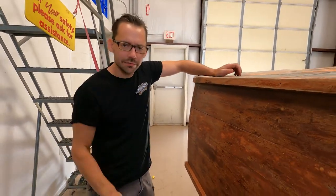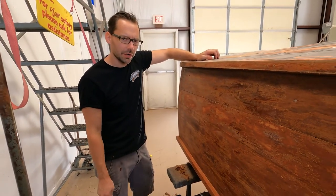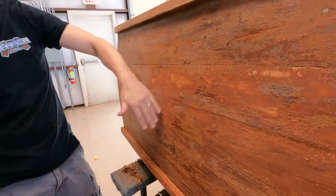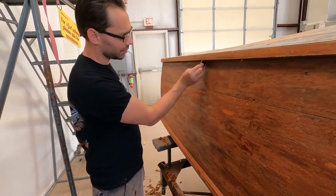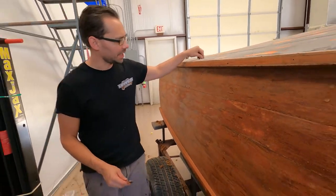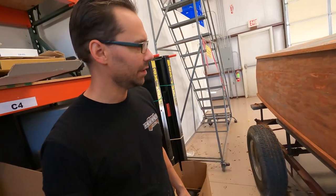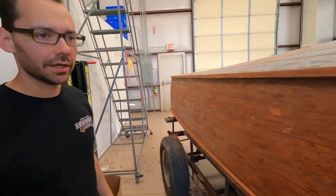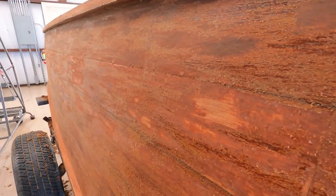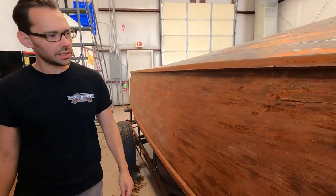I think that's enough for today. We did some stripping on the side here with the aircraft stripper and got most of the varnish off. That stuff is on there good, but the reason we used it is because last time on the back we just tried sanding, and it took forever. So this speeds up the sanding process. As you can see on the ground, we got quite a bit of stuff off — there was probably at least three layers of different varnishes applied at different time frames, including the original varnish. It's pretty decent looking underneath all that, and I'm pleased we've got good wood to start with. It's got a few lumps but I think we can block sand them out and get the sides of this hull really nice and straight. So we're going to do some cleaning up here and we'll see you guys next week.